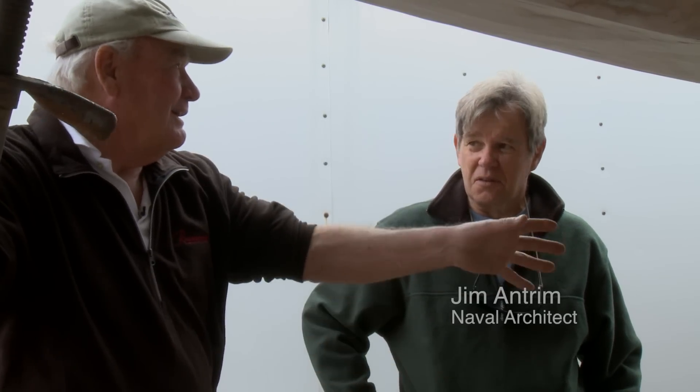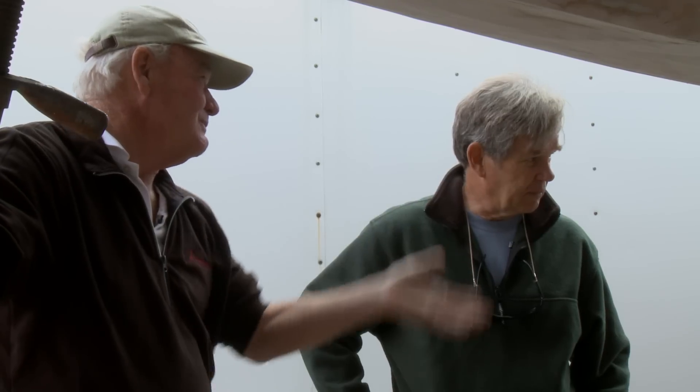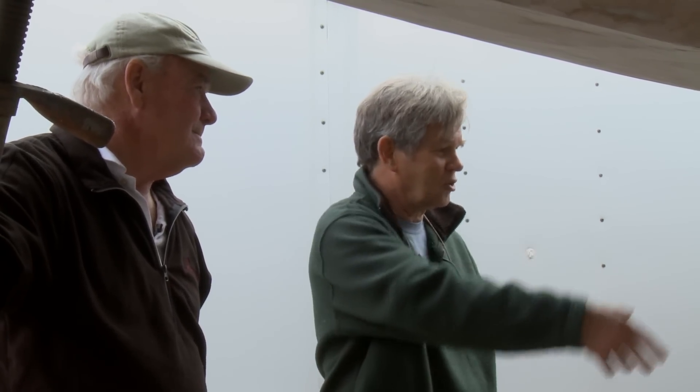The other thing we wanted to talk about is the installation inside and how the floor plan is laid out. This boat has a reputation for a lot of oil canning — it's flexible, with big panels that aren't really supported very well. Back in the day they used layers of mat and roving, and if something wasn't stiff enough they just added more layers, but it didn't necessarily make stiffness a priority. So the boat has a reputation for the keel kind of wagging and creating deformation in the flat floors. Because this boat was very flat for its time, it's not fast to have your ballast going to leeward — it's kind of counterintuitive.